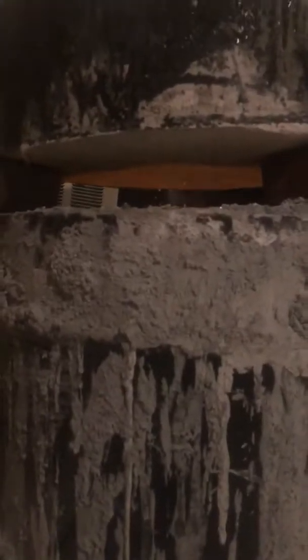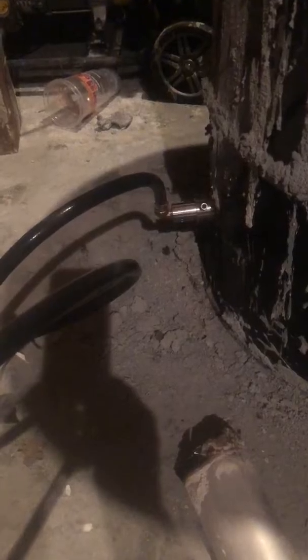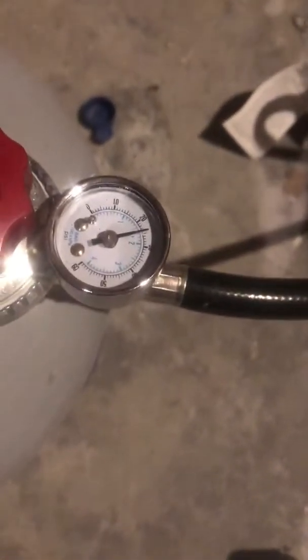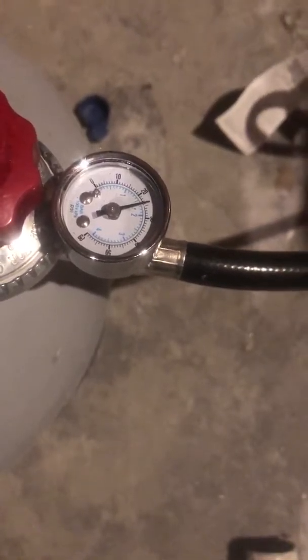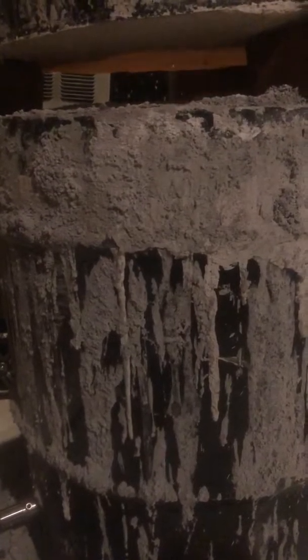Right now it's my first fire and I'm drying out the refractory cement. It's on its lowest setting — the least amount of oxygen coming in through the side — so it's a pretty soft yellow flame. I do have it turned up to about 25 PSI though, so the heat's really going into it. This thing has had about a month to sit, so I'm hoping the concrete isn't going to flash-boil and explode.